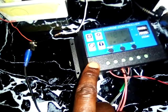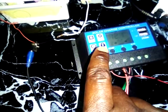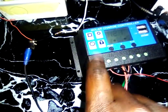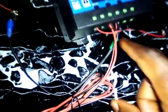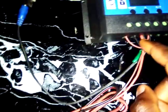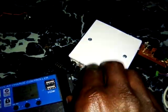It's not too bad if you want to use the simple controller. I'm going to explain how you can improve its efficiency. All you do is introduce an inductor on the wire that goes to the battery before the output — that is the positive line — then you put a diode in reverse bias mode, so that the DC voltage coming in is pumped into your battery. That is exactly how it works.